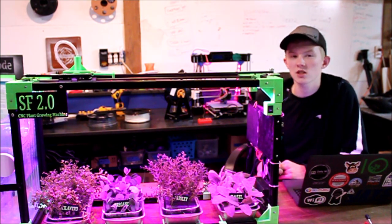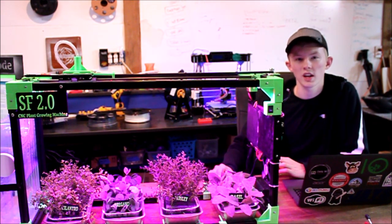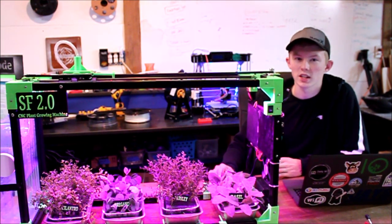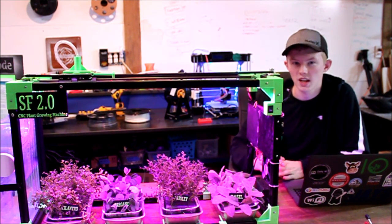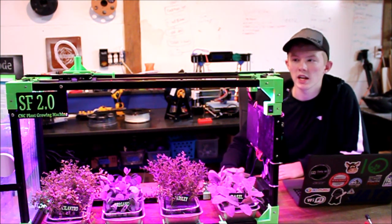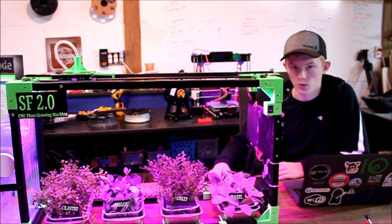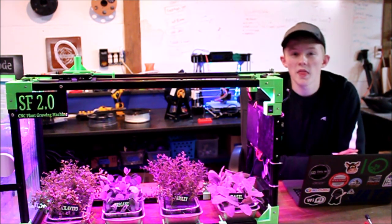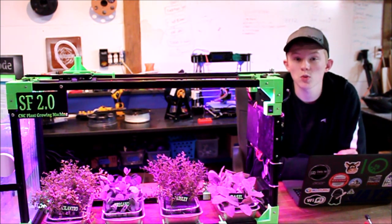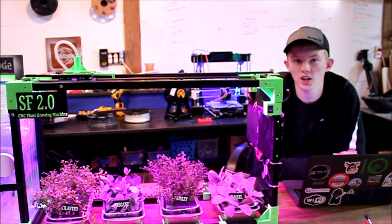Once they started coming in, I started assembling a few basic things. I assembled the main frame, and then I started working on assembling the electronics. So I started out by wiring the electronics together in small groups to see how they would work together overall. For example, I started out with the Arduino, one relay, and the lights. I messed around with the code to figure out how they work together to get that to work overall with the main code. I then started experimenting with the hydrometers to see how they worked with the soil and with the Arduino. I would test one hydrometer in different moisture contents to see how the values of the output changed.